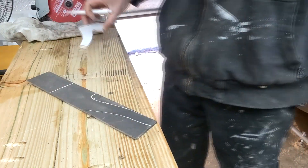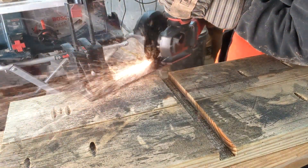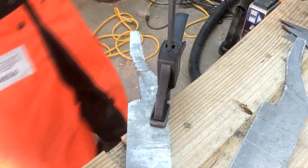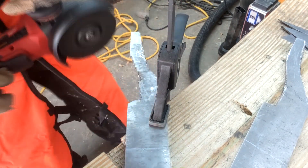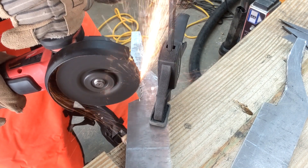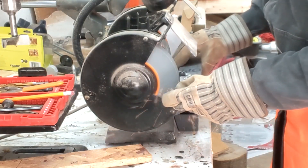So now I had the right width, the right length, and the right shape for making an awesome blade. I cut out the steel using the same methodology as before — the only difference was I had better angle grinding plates. The biggest difference in this methodology was my method for making the teeth. Two big differences occurred: first, I measured the distance between the top of the tooth and the top of the ice axe to make sure it was thick enough. Second, I noticed these teeth stair-stepped, so I bought a very large 5mm angle grinding plate that I could just push in and slowly grind more and more away to create a stair effect. I also used the bench grinder to get that stair-stepping effect and really hone it in.